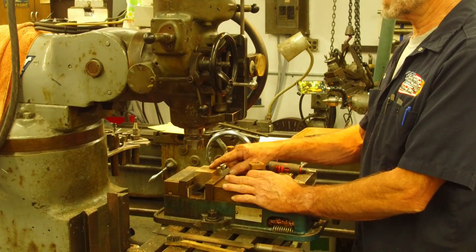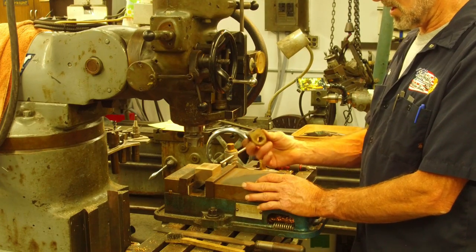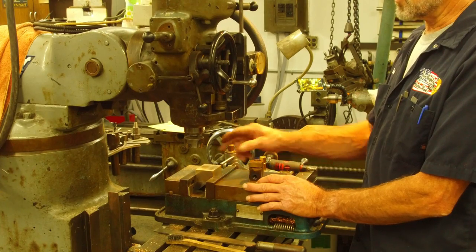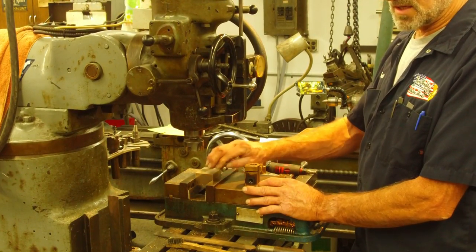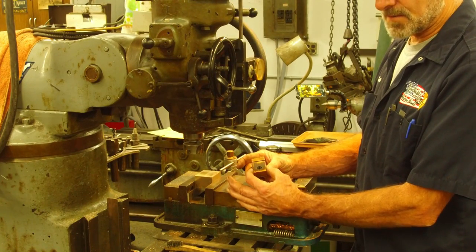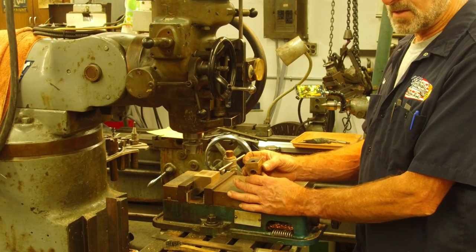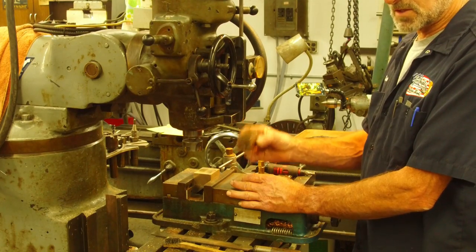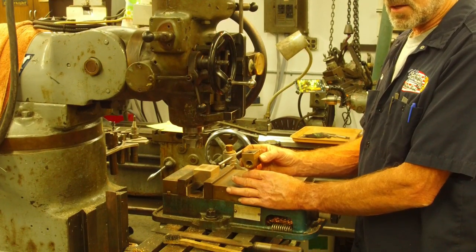We're probably going to take that to 1 1/4 to start. We're going to start out at 1 1/4. We went over and we test fit this in the groove again, and we know that it doesn't have too much slop in it. So we're going to be probably fine-tuning that till we get it into there, because we want that to be a tight fit. It can slide a little bit, but we want it to be tight. We do not want this nut to be slopping around, because once it's located, this nut has got to stay located in a good position